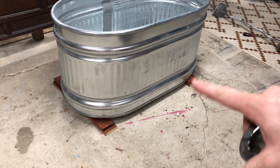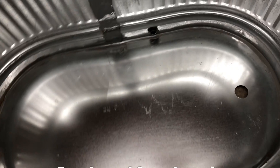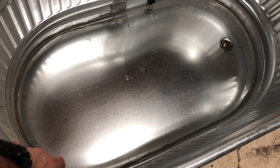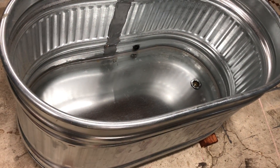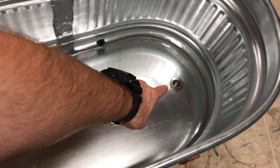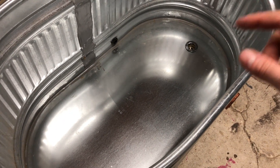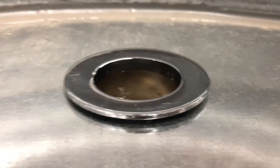I've got the tub up on shims so I have a little bit of space underneath, because the drain assembly needs to sit down inside. The drain that fits in there actually sticks up around the edge, and when we did this last time we had a lot of trouble with the water inside draining out — even though I built the floor with a grade going toward the drain. I thought the grade would be enough; I didn't realize there would be such a big hump. I only need to inset it maybe an eighth of an inch.